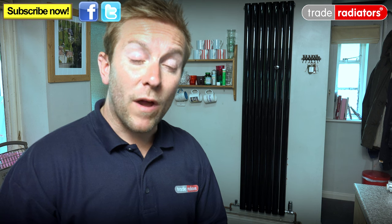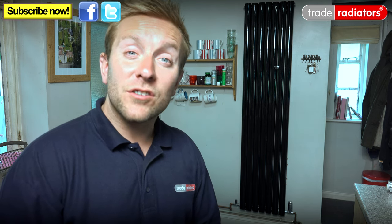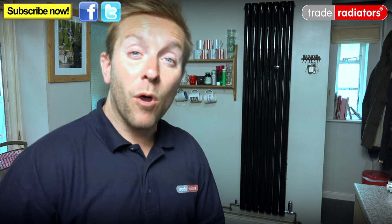If you find that putting in a new vertical radiator made other radiators in the house get cool, then refer to our video on balancing a heating system and that should see you right. Also, strangling down the lockshield on a vertical radiator can stop the often trickle noise that sounds like water falling down a waterfall, because it reduces the flow whilst not actually affecting how hot the radiator gets.